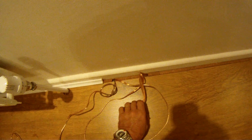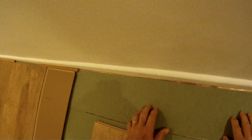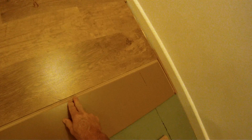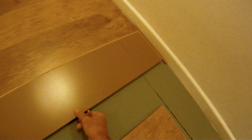The other thing to think about when you're laying laminate is whether you're going to have any speakers or other things in the room. I've already pre-laid some wires for speakers in all four corners of the room, which you can sneak next to the fibreboard. Here you've got the foam underlay, wire on top, and the fibreboard butts up to it reasonably flush on top, so the cork just goes on top of it. Now I've got the pencil — we'll just mark off where this has got to be cut, straight with respect to the other board butted against the cork. The advantage of this technique is you get an accurate cut even if the wall is going off at a funny angle.